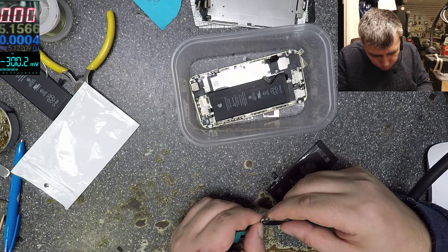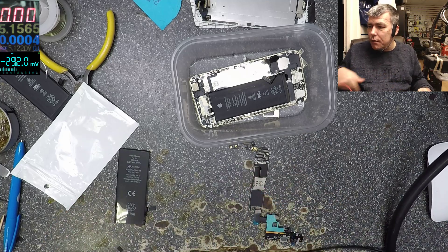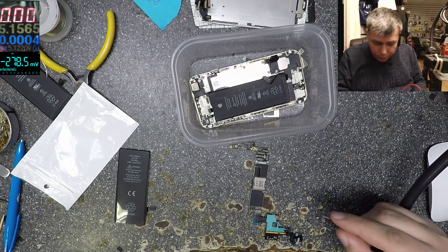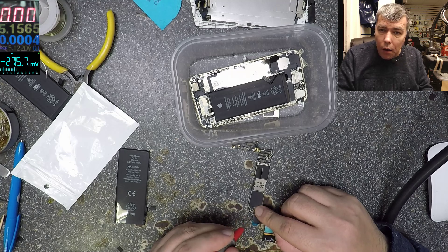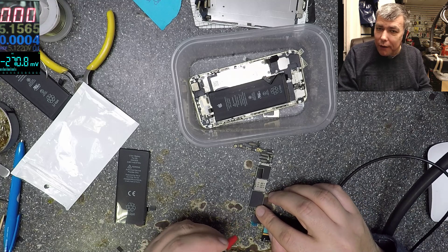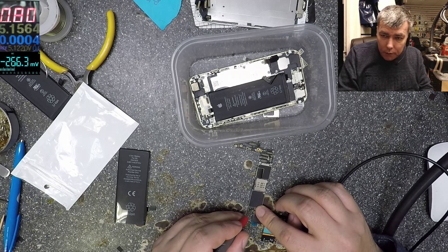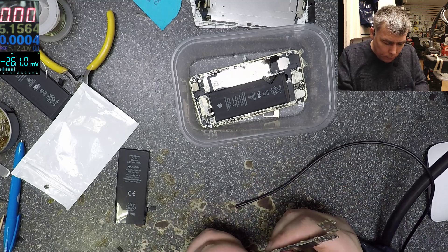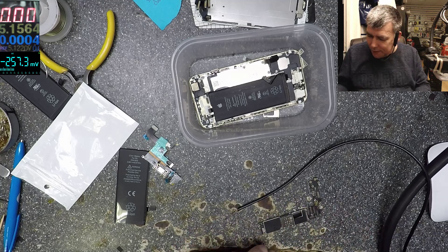Let's see now. Maybe I should try the board to see if it's shorted first. It's reading 3.9 volts, around 1.5 amps — that's not good, it's taking 2 amps. This is a good opportunity to check my freezing spray. 1.6 amps on the plus. That's ground, that's plus, so it's not even worth checking visually yet.